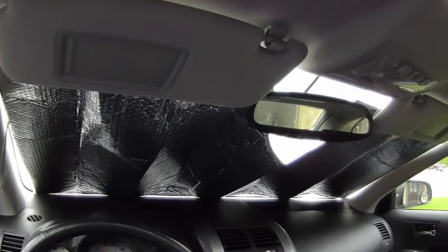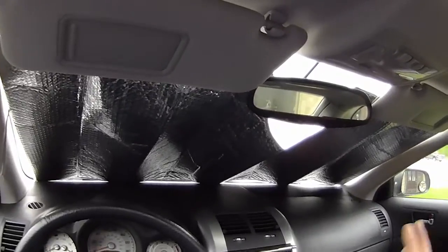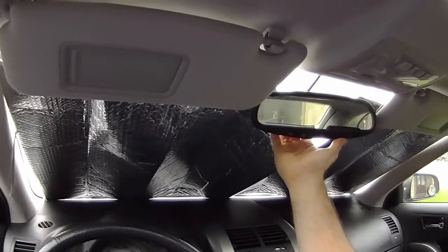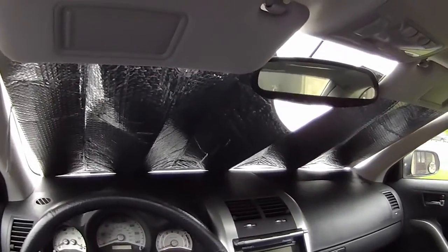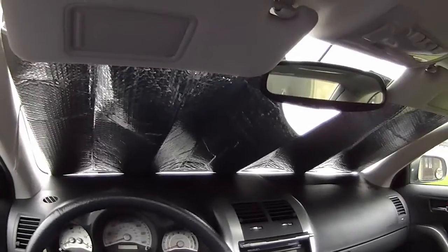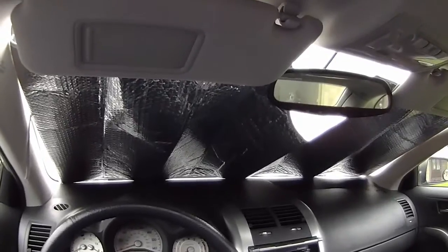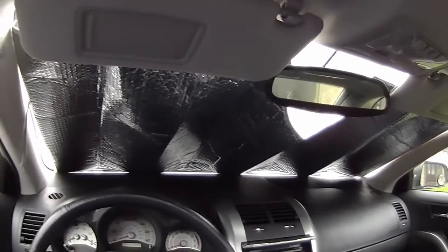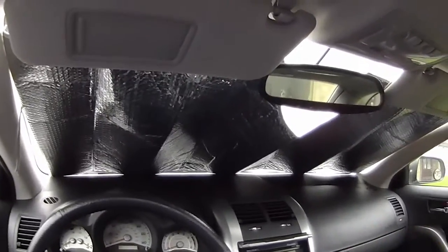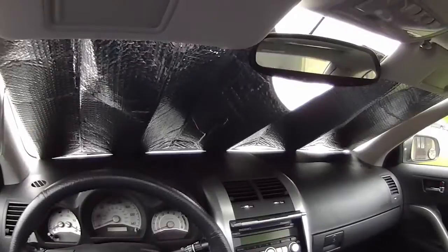This is a follow-up to the video I posted about the Gentex 313 mirror being modified with backlighting. I finally got it installed in my car. I ended up using the connector I got off a USB bracket for about three bucks, and that worked perfectly — it even fits tightly in the connector, so there isn't much risk of it popping out from driving vibration. It's very secure. It only needs three wires, so I figured out where to tap that into my car and made it work.